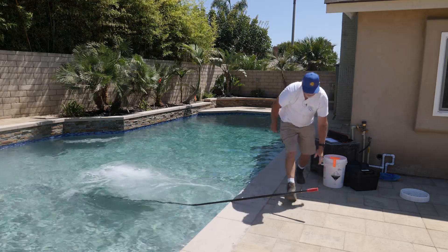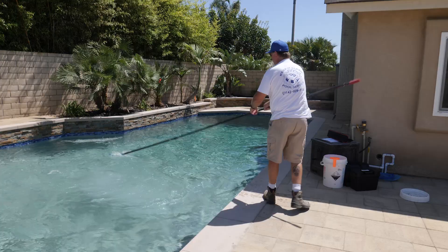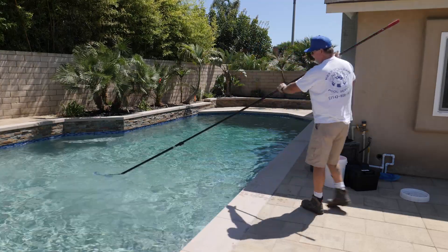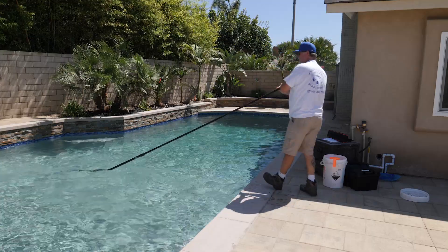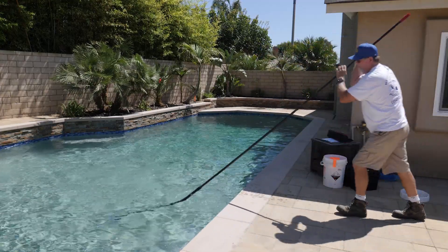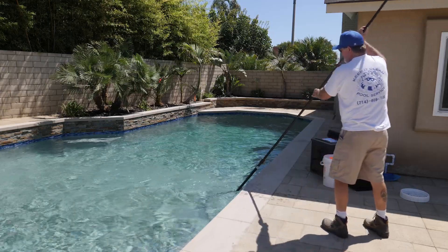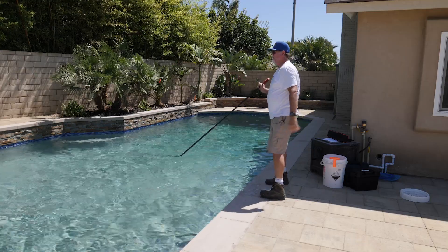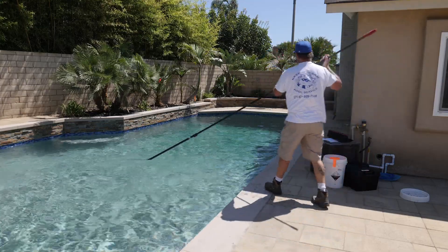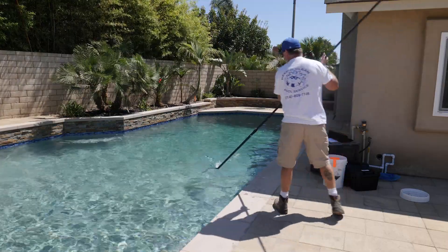That's a little less than 35, so we'll see what we've got. Now again, if your pH is down to like 7.3 or 7.4 with a low calcium hardness, we've got a spa over here with about a two-and-a-half to three foot spillway that's aerating the water anyway. But if you need to bring the pH back up, all you need to do is run your spa, aerate with the jets, or if you've got a spillover just let it run — it'll raise that pH back up and you won't have to add any soda ash or bicarb or anything like that.